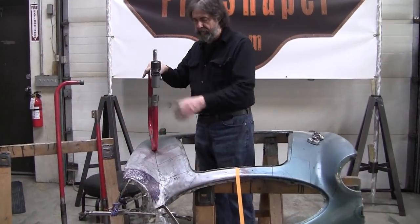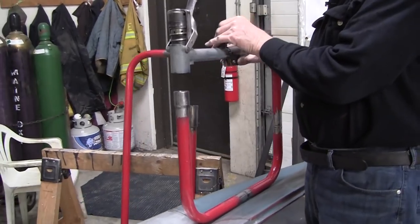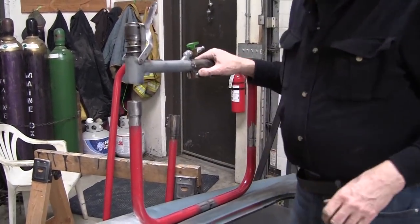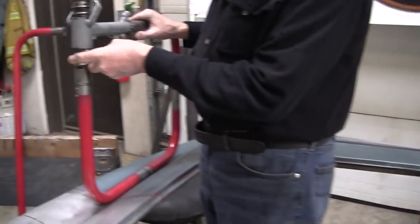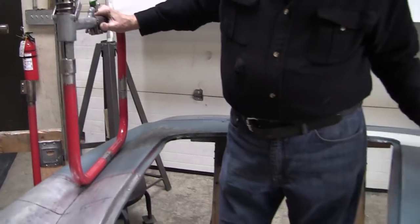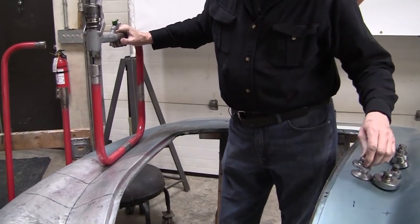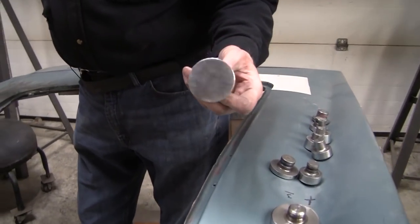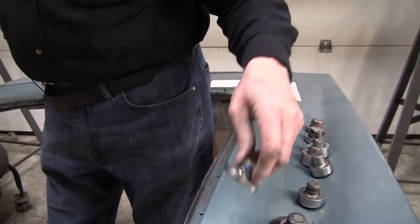So here's my mobile air planishing hammer. This is a Chicago Pneumatic head on it, and you've got adjustment for the air — so that gives you the amount of hit that you want. And here's the complement of dies. This one I made, it's a big heavy one, and these pop up in here. I've got for the top heads — the top heads have a little retainer in them — so we've got a real big heavy one, then a pretty good size one with a light mass to it, and this one's a little bit smaller.